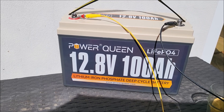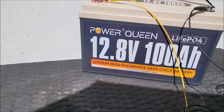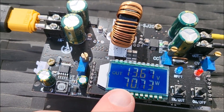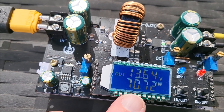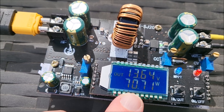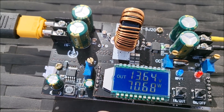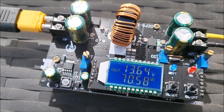I don't know quite where the battery is in terms of its state of charge, but we can estimate it — with 70 watts of power it's being pushed up to 13.6 volts, so I don't think it's anywhere near fully charged because we'd be looking at voltages closer to 14 volts if it were near the top.